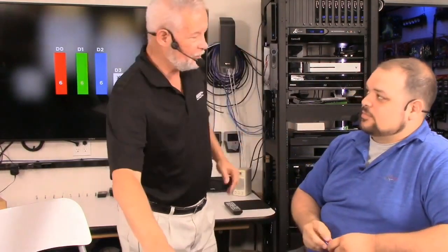Well, when you're looking at distance, we're going to make the assumption that you have purchased a good cable, one that is four equivalent channels. The distance that you got from 18 gig will be the same distance you're getting from 24 gig. Now, if you put in a good quality four equivalent channel cable, like the Velox Passive, you can always add, as you go extended distances, our new GA2, which is a full 48 gig repeater. So you're not limited in distances.